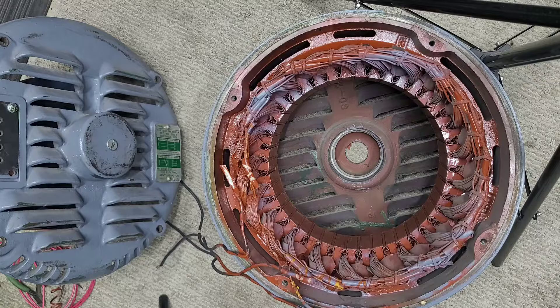When it arrived and I saw that, I figured most likely this thing was rewound. Sure enough, I looked on the side and there's actually a tag that says Topeka Electric Motor Repair with their number and everything. This motor was definitely rewound. They also have a sticker on the side that says it is 460 volts and that's it — no other voltages mentioned. So at that point I said okay, it's been rewound for only the high voltage setting.